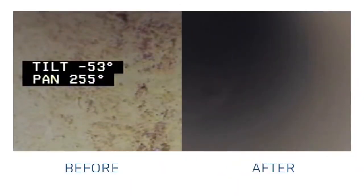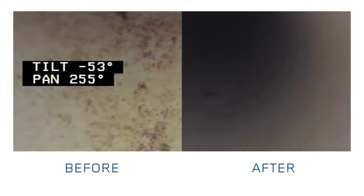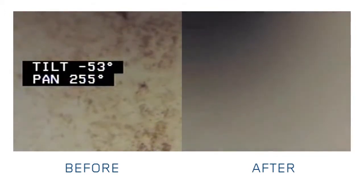If we don't take the proper actions, the customers get no water. In unfiltered systems we can often see there's been a historic build-up of sediment, and there are very few ways to remove it. Biofilms can be difficult to remove because they tend to be quite sticky and greasy around the inside of the pipe, and certainly don't get removed with water flushing.